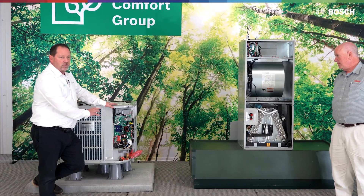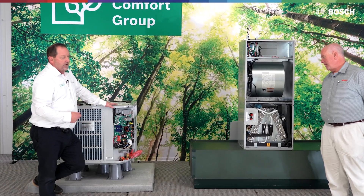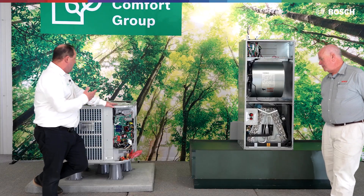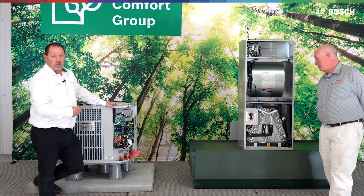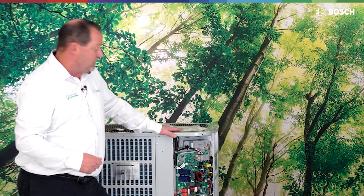This actually on the previous board housed a miniature transformer. And so now it's just one thing again — notable, so that if I am going in there assuming I'm checking a 24-volt coil, I've got to be careful now because it's going to be a 220-volt coil. So that was another thing there. We also added a second pressure transducer.